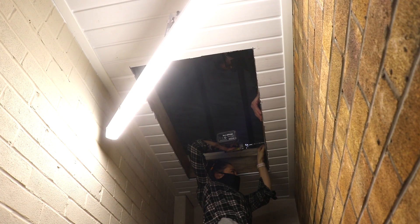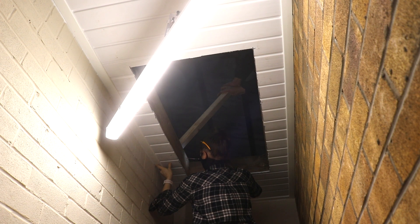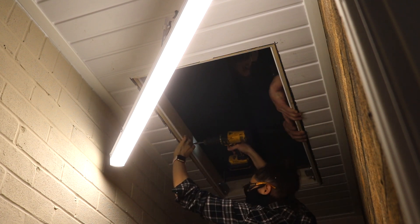Once that was done, the gussets were no longer needed. I could then take the Youngman loft insert up to slot in with the hinge part facing upwards and towards the back — and I really do apologise about the terrible lighting. We tried to make the loft insert level with the fascia, but found the fascia needed to be trimmed slightly in one corner just a touch. I then worked on getting the middle of one side flush with the fascia and screwed that to the frame.